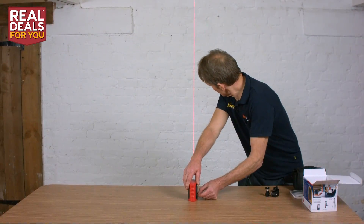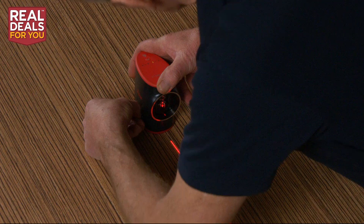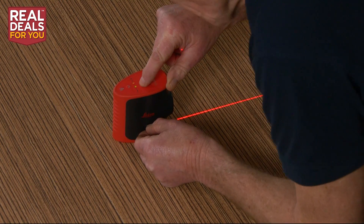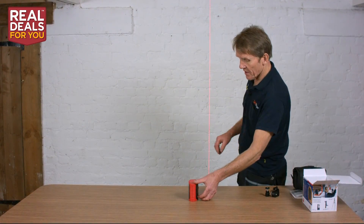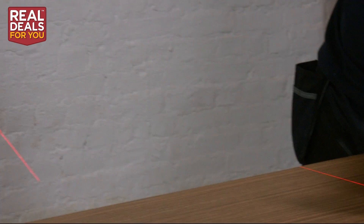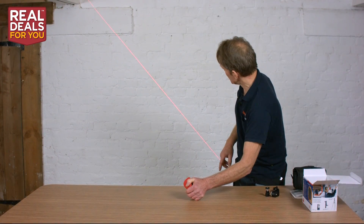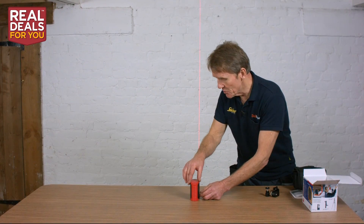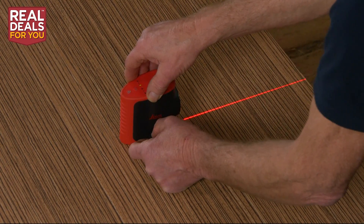On the side here there's a lock that takes us from one position to another, and you can see on the top it shows a little light that says it's locked. Why would you want to lock it? The reason is that you might want to run a line at an angle — so if you were setting out a staircase, you would lock your line so it's no longer leveling but still giving you a straight line laser. That way you can set out a patio or a roof for example, so it's very useful to be able to lock it.